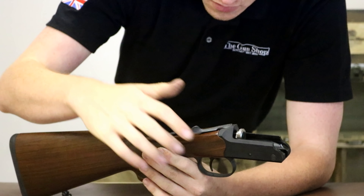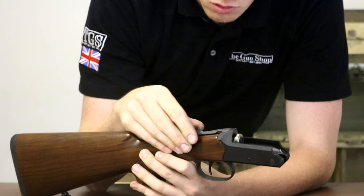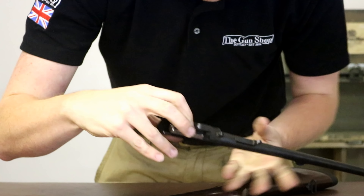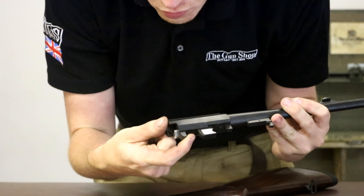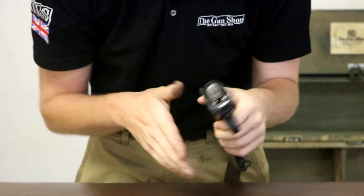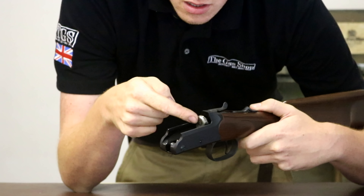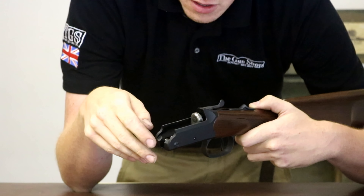The tilting block is crisp and nice and it all goes together very well. The tilting block locks into the bottom of the barrel lug and closes up, locking in line with the barrel so you get perfect headspacing every time, keeping the joint independent of the action. This little drifting pin on the side presumably allows you to remove the face plate, so you should be able to change caliber with relative speed.